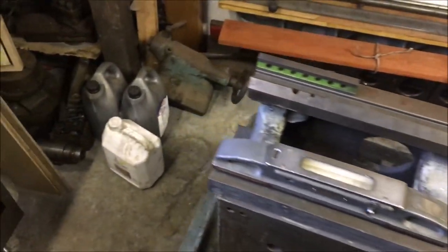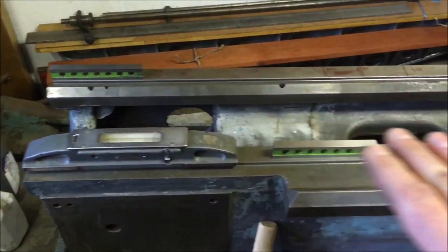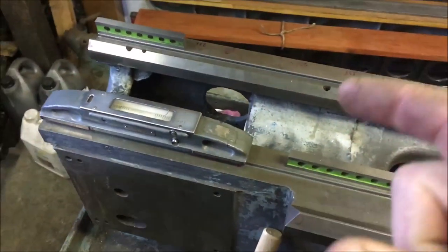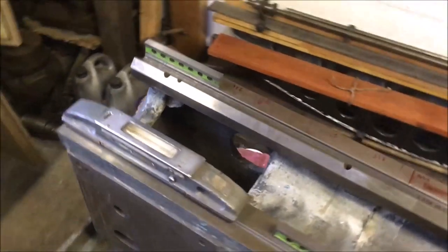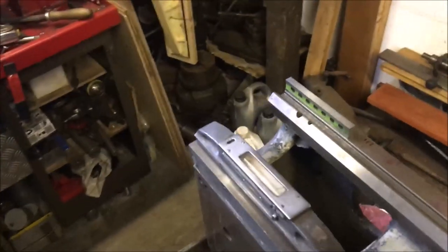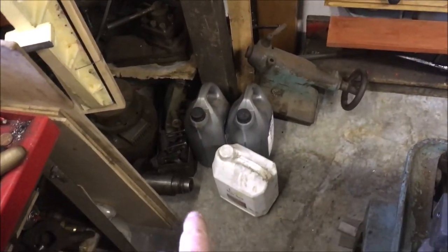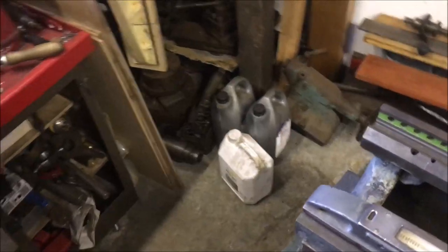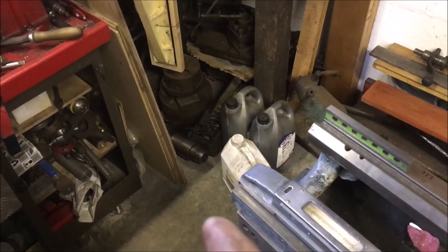One of the points Chris has raised is when we've got the bed on for the headstock, which is after we've trued up the bed, we get that to sit on. We know that the bearing sleeves, which are white metal, are pretty badly worn, I think in the region of 30 thou worth of vertical lift at the chuck. So in order to get the bearing scraped in, we need a test bar. The end of the spindle takes a sleeve, and then that sleeve has a number 3 Morse taper down the middle of it. Now I've got neither a test bar nor the sleeve.